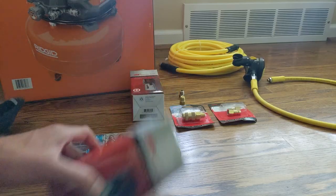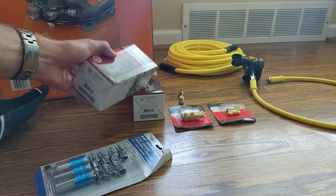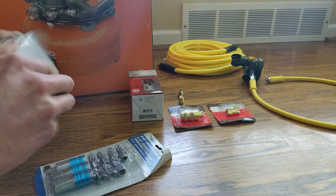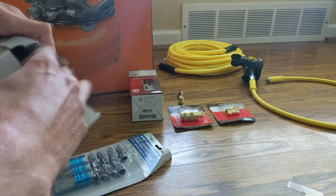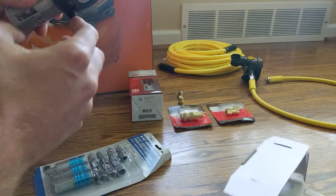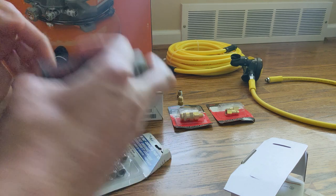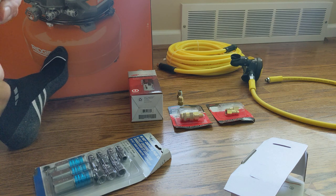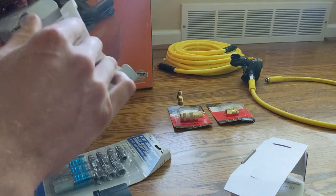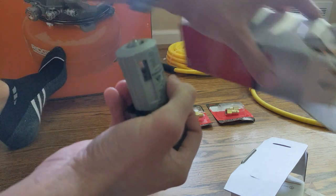All right, so we're going to start by unboxing the filters and the barb ends, which is pretty straightforward. These parts on Amazon are pretty inexpensive. I opted to go with 2.3 micron filters. Reason being, you only have one life, not to push the whole YOLO thing, but it does raise some concerns: I'm going to be breathing in air that's literally being brought in by an air compressor. What sort of oils from assembly? Even though this is an oil-free compressor, there could still be some assembly lube on it or some other residue that I'd prefer not to breathe in. So I went with 2.3 micron filters just to give me a little better peace of mind.